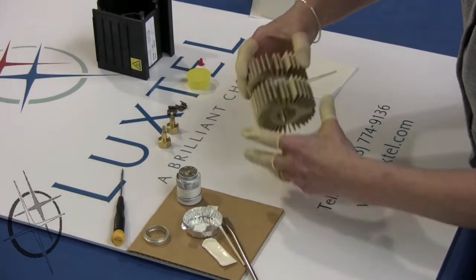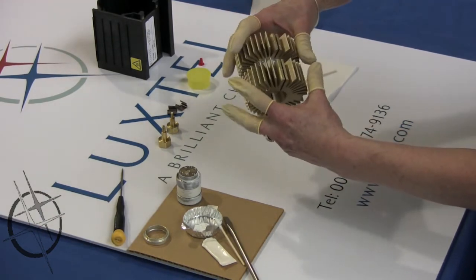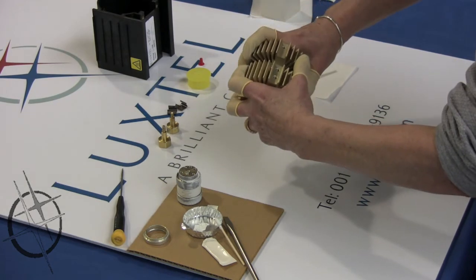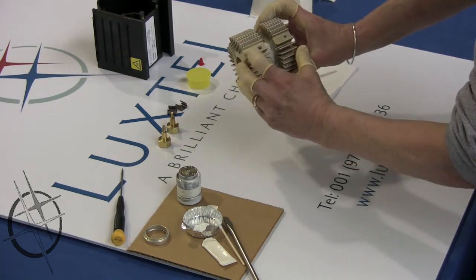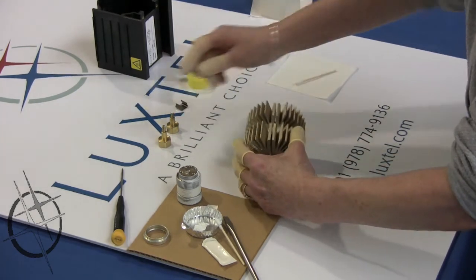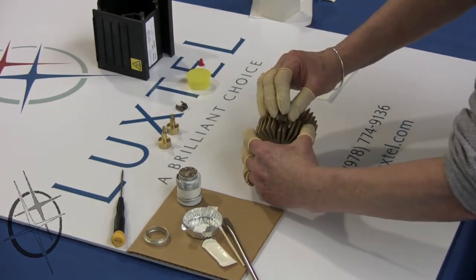Step 17. Align the holes on the heatsinks and replace the copper clips. Twist the heatsinks until the 3 holes are in a straight line. Once they are, turn the heatsinks 180 degrees, replacing the 2 copper clips that were removed previously. Make sure that the clips sit snug against the heatsinks.